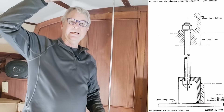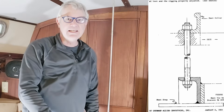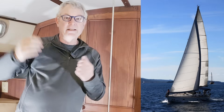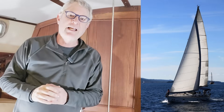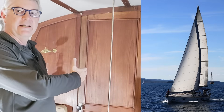This post is meant to reinforce the deck and hold it down relative to the space between the deck and the keel. You might ask what force would cause the deck to rise, and that is where the meat of this discussion is going to be. The mast and rigging are designed to transfer aerodynamic force from the wind caught through the sails and transfer it into hydrodynamic force that moves the sailboat through the water in the desired direction.